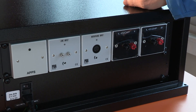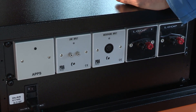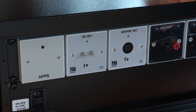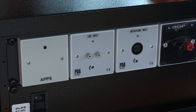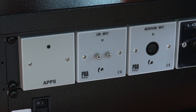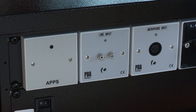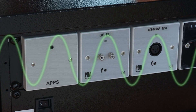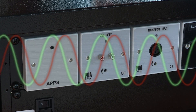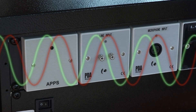We've also got a microphone input that we can put in, and a line level input that we can use for background music, a PA system, or a radio mic system. We're also going to be putting the test equipment in through that plate as well. And then finally we've got the APPS which is a phase shifter plate which takes any of the signals input through the outreach plates and splits it 90 degrees and puts it into the amplifier. So everything you need to do the phase array system is contained in this one rack.